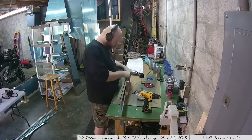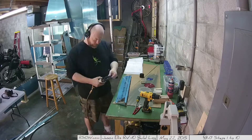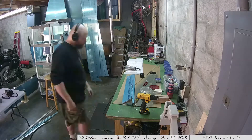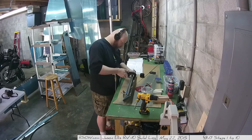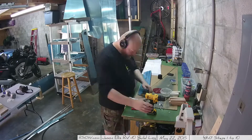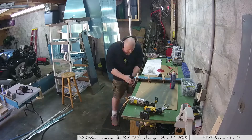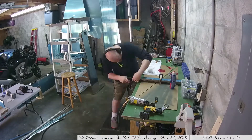Here I'm putting the spray glue back in and putting the ribs back in — I doused it with that spray glue, it works really well. For this particular piece, because of the nature of how the skin is a folded piece as opposed to two pieces coming together, I did not see the need for tank sealer. That spray glue is amazing, I've used it for years and years — those pieces will never come out, so I'm perfectly satisfied with that. I'm sure there are purists who will disagree and tell me I did it wrong, but so be it. The nice thing is if they're ever right, I can always fix it — this is one of those pieces where it would be fairly trivial to remove and fix. It's kind of taught me that nothing is permanent; if anything needs to be fixed, you can fix it.